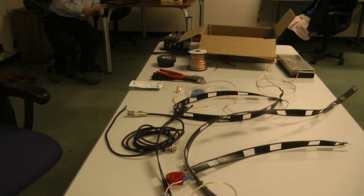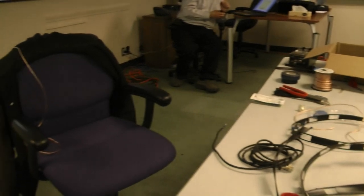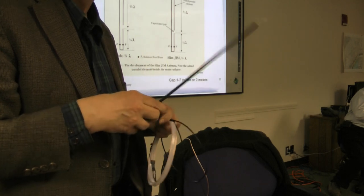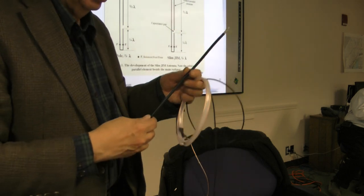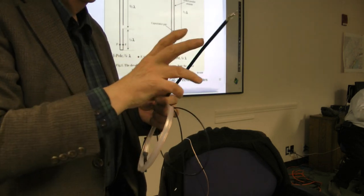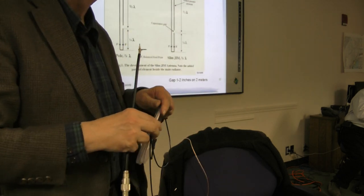Also, whether people want to buy the 50 cent beads, which is a real bargain. And I highly would recommend, now that we have some, that somebody must have a few feet of RG8X or something. That's for the beads, so that we'll work it out, because the antenna doesn't do you much good unless you have something on it. One possibility I was thinking of, and this is only this light because I found it in my scrap pile, is not real scientific, but it struck me it'd be real handy to have a thing with the beads and the connectors, and now you have something that you could use on different antennas. You could fool around and make different things.